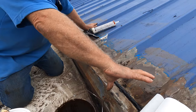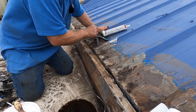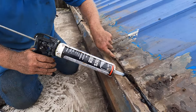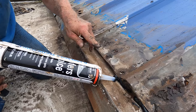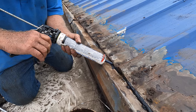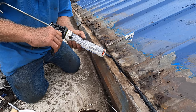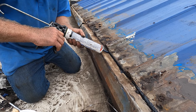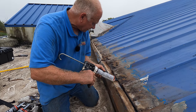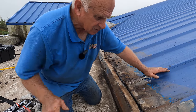I want to make this transition now — that's the next step, not the final step. First, I don't like this sharp edge here. I want to cover this gap to avoid a sharp edge. So I'm going to put some roof cement — tar, flashing cement, whatever you want to call it — and fill up that gap so there's no void behind my transition.